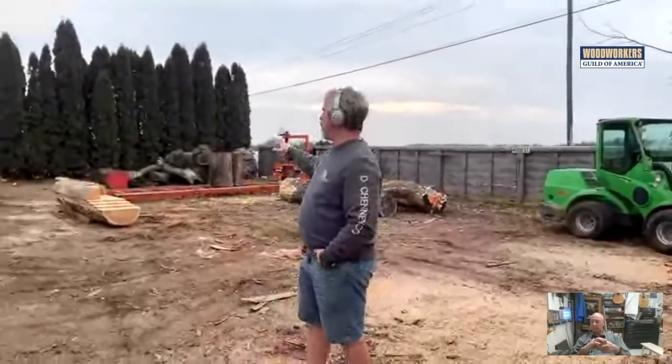So the log behind you that you started quartering, if you just threw that on the mill and plain sawed the whole thing, what would cutting time be? You're looking at less than a half an hour. Holy buckets. And if you quarter saw it, well, you're already an hour in, so like four times that. Yeah, you're probably an hour and a half with another guy to pull the lumber off. You're probably an hour and a half in quarter sawing that log. Wow. It works out well if we bring the edger over. Once we cut a piece, we can throw it right through the edger while the sawmill's cutting another board. One's going through the edger.